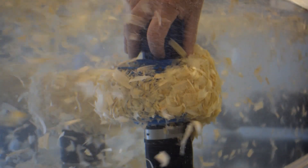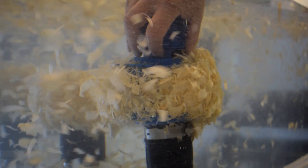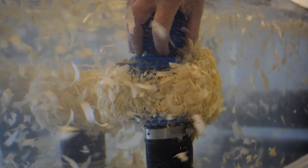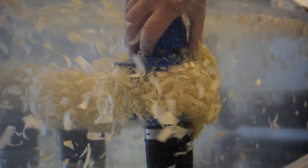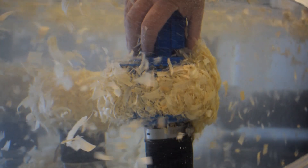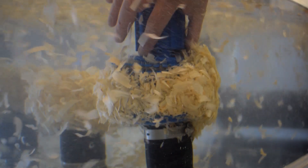When the top disc pulls down, it exposes a small orifice here which just allows enough water to go through to keep the pump system from running dry. That's a safety feature, but you mustn't allow them to run for too long like that, because there's a tendency to draw debris through the holes. But certainly with things like mono pumps, it can be the difference between saving the pump and the pump becoming obsolete or needing expensive repairs.